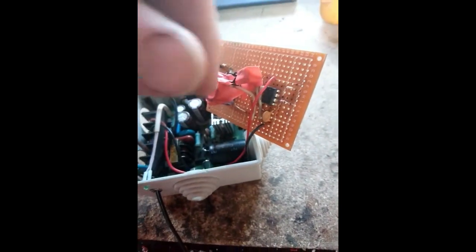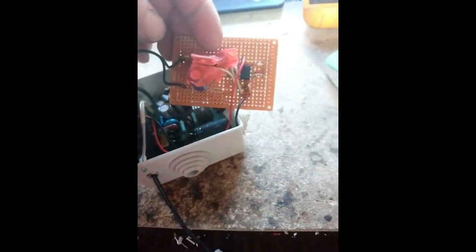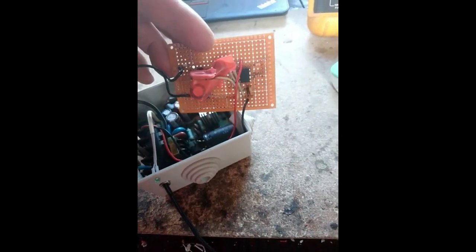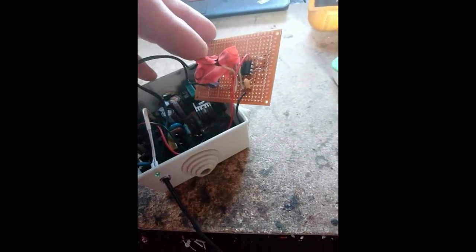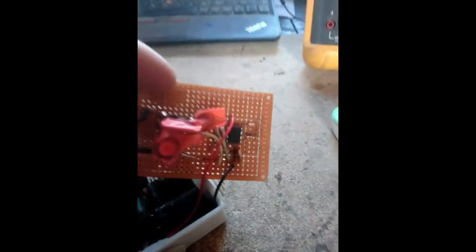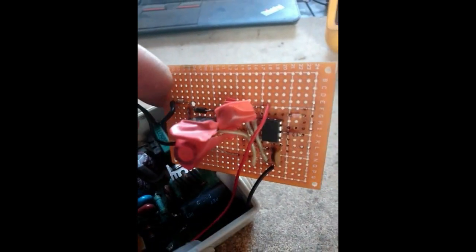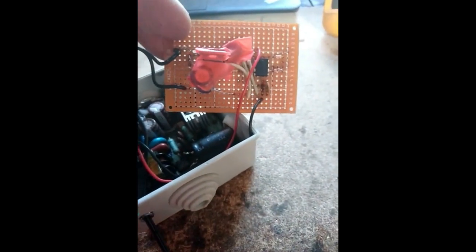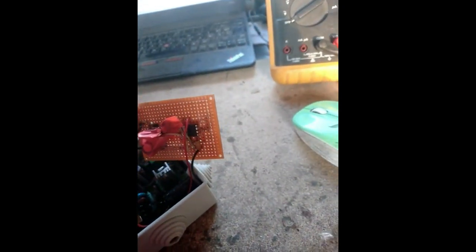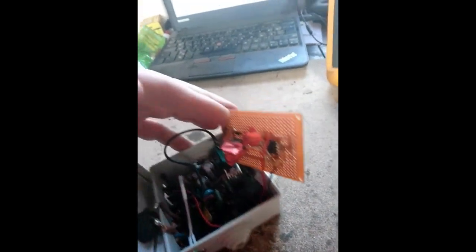Output then comes to my circuit board here, which is the tester — not much to it. I put a little bit of tape on there because it goes in upside down. I was just wary of creating a short — there's metal on the end of that capacitor, and on this transistor, so I wanted to cover that up. There's the 555 timer, and that's the little board. You could shrink it down and make it smaller onto half the size of this board, no doubt.